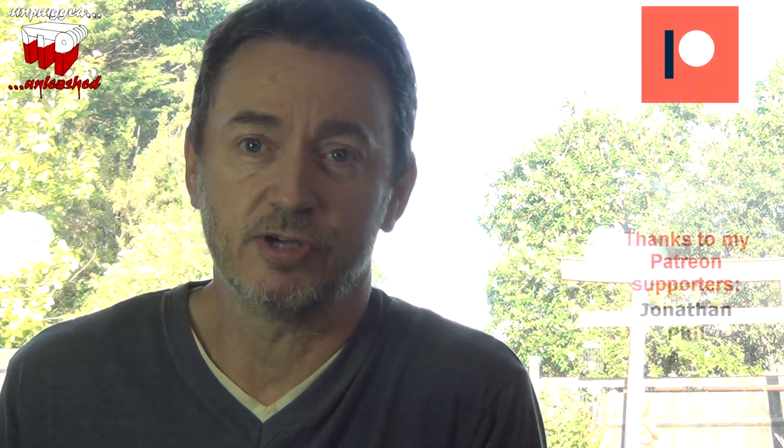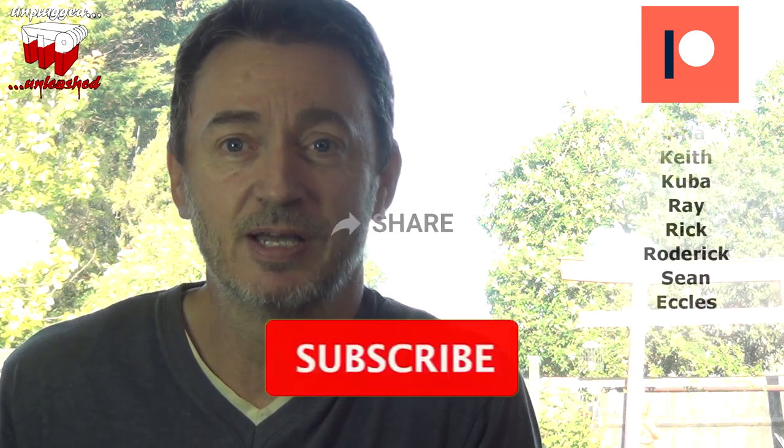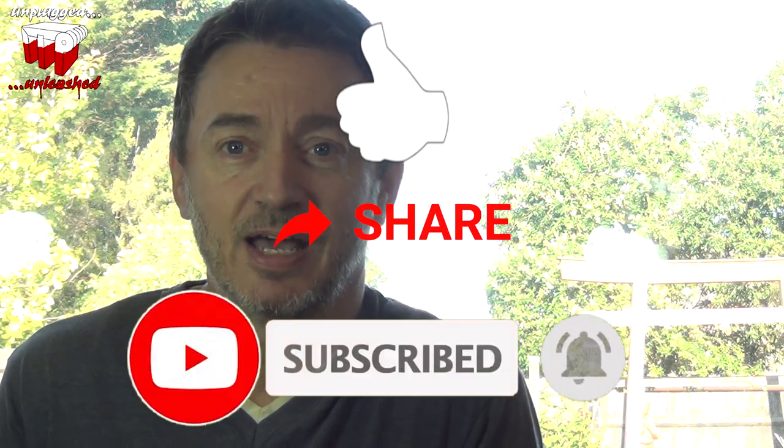It hasn't been my intention to put you off power sanding or using sandpaper, but I did think it would be nice to show you that you don't need to do that to create what I think you have to agree was a really good finish — achieved using a lot of mixed techniques. We didn't just use one technique, but we've ended up with a lovely finish using scraping, low angle irons, or even a scraping iron — a 50 degree bevel in a low angle plane. All different ways you can get excellent finishes on end grain. As a little bonus, I showed you how to use card scrapers without burning your hands, and how to prepare them for use. I hope you found it useful — please like, subscribe and share this video. I hope to see you again soon.